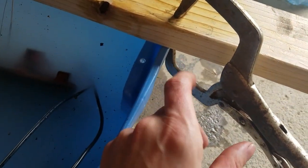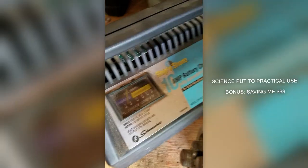Now I've set up provisions to allow my negative lead to be attached to it. After submersing it in the washing soda and water and connecting both leads, the positive to the rebar and the negative to the intake manifold itself, and turning on our power source, look at the bubbles being created. Those are actually hydrogen bubbles. The electrons are moving from that intake manifold to the steel rebar in the solution, and with it, it's taking the grease and the rust and it's cleaning that part from all around it, inside, the outside, and I'm going to let this sit for about 24 hours.